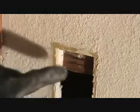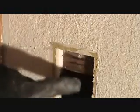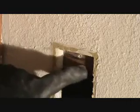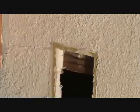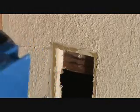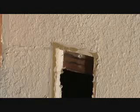You know, another thing I could have done was drill this all the way out up there if you had a bigger paddle bit, and if you're concerned about, hey, how do I drill just a 1/4 inch of the wood or something, you can go up further, and then you can drill maybe a hole in the back of the box and put an angled screw up into the wood, because you measure this box, and I measured this box here.